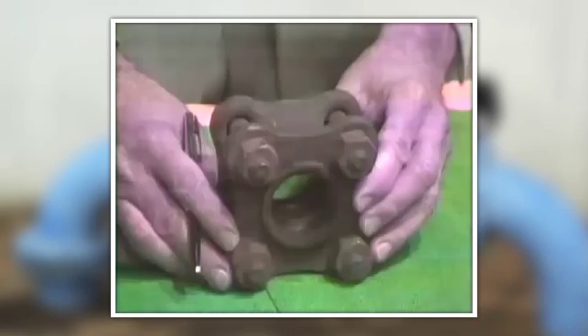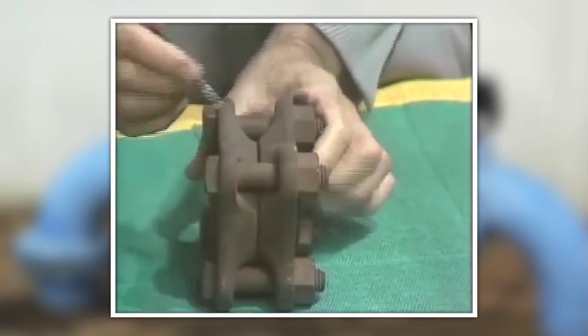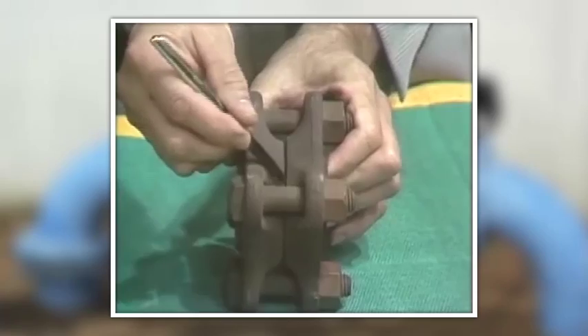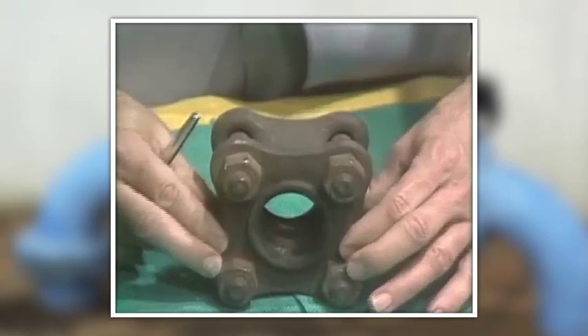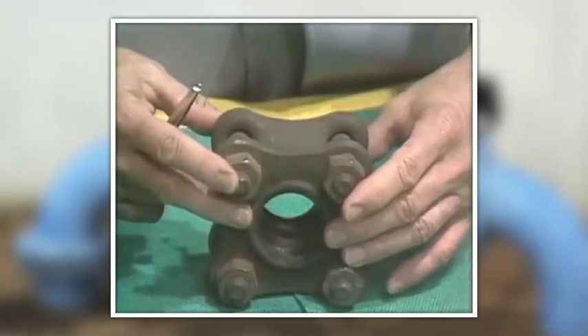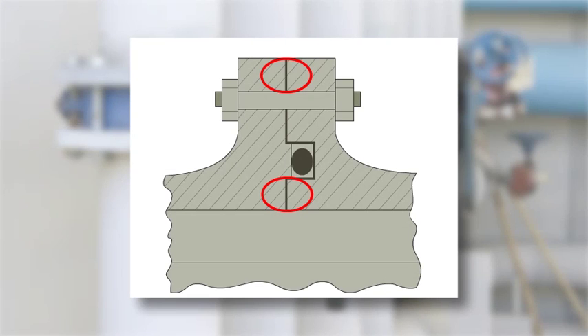When O-rings are used, they are put in an enclosed groove, like the one on this four-bolt hydraulic pipe flange. Then when the flange is bolted on, it comes down metal to metal. Remember the margarine? We're cutting a cross-section right through here. It's bolted metal to metal right here, but this only slightly mashes the O-ring on top and bottom.